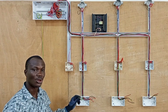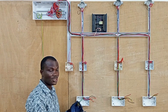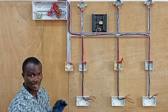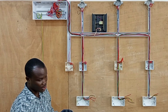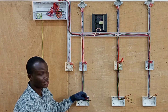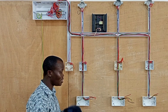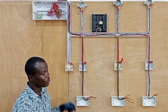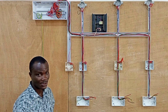We are going to put all the yellow and green wires together and connect them to the terminal marked E. Then we put all the blues together and connect them to the terminal marked N. Then we put all the reds together and connect them to the terminal marked L. If you want a detailed explanation of how to wire circuits, look down below this video — I have a very comprehensive video on how to do that.